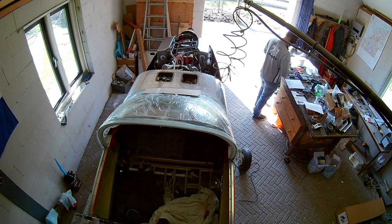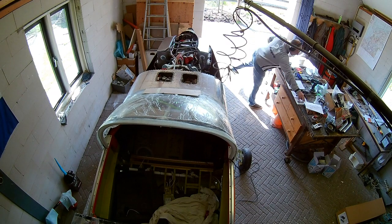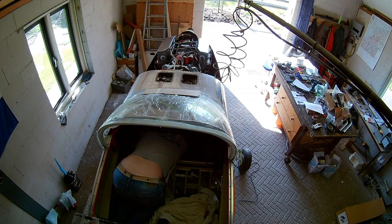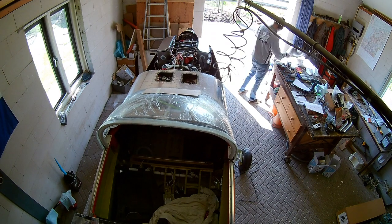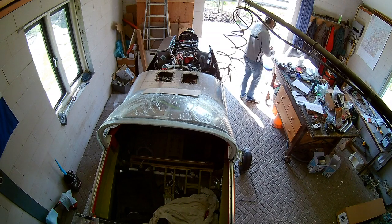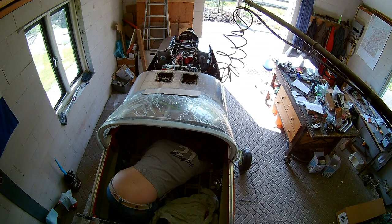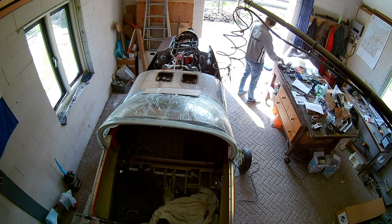I had a fuel setup which was not completely correct, and unfortunately now I have to crawl into the airplane because I already covered the forward top skin. I can't stress enough that it is very easy if you do not install the forward top skin before you have all your avionics and your fuel lines set up correctly, because it's not very handy to crawl into the cramped space through the cockpit.